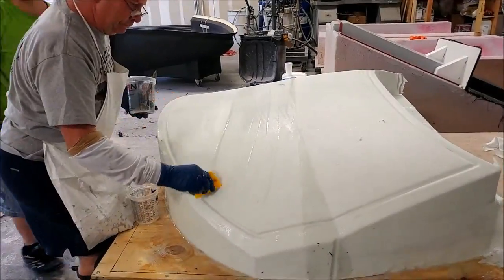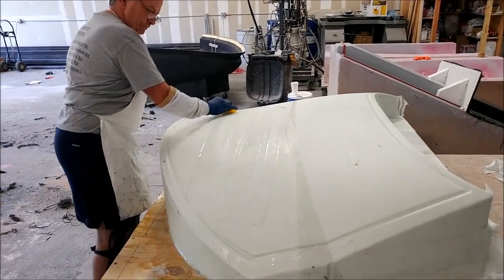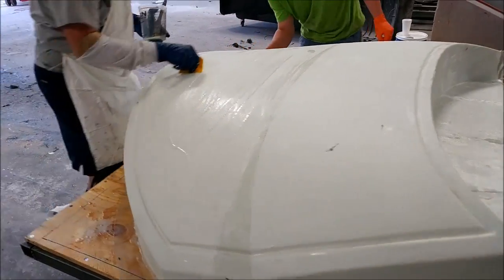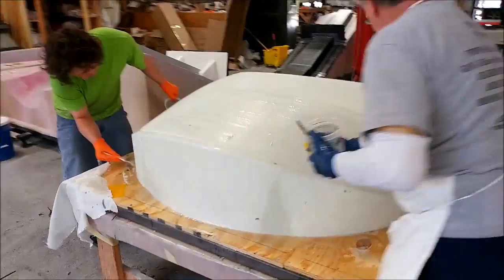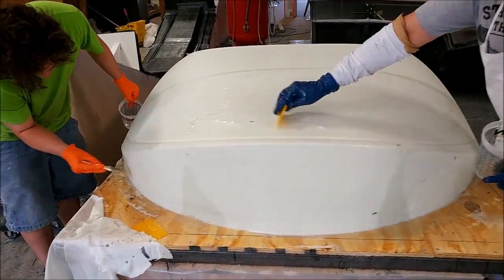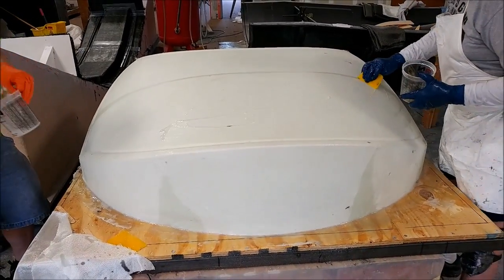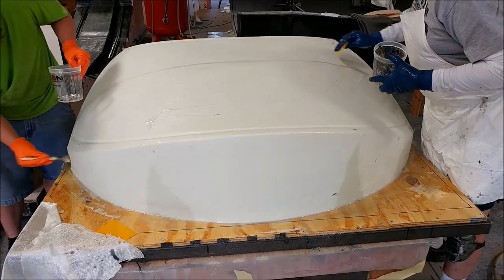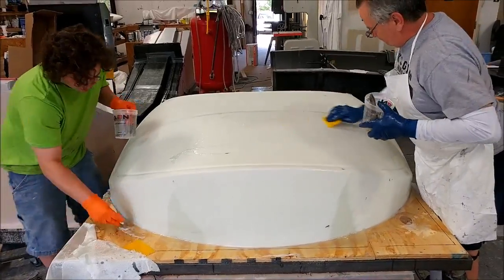Here is the fixture we're going to be using for trimming the front windshield, and that's getting just a light layer of fiberglass on there so we can spray it with putty and then put it back under the mill again. This is a similar process we use for creating our plugs, but this one will be used again and again as a fixture.